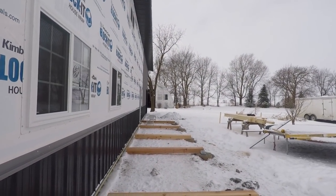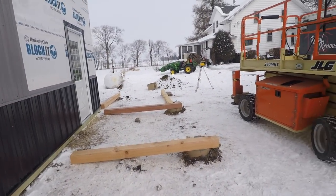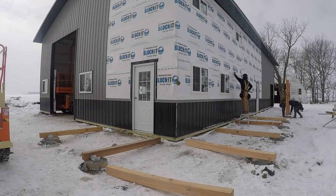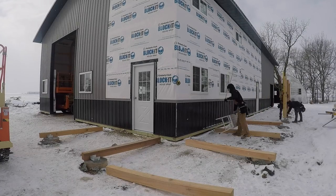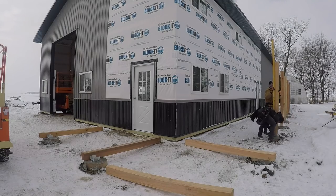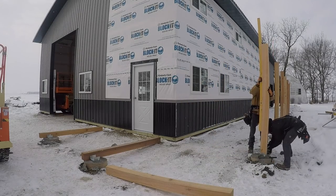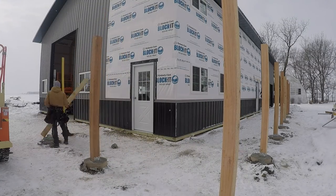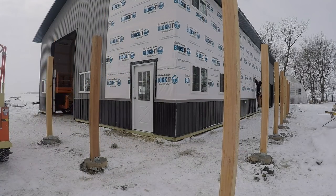Just a nice little gentle snowfall. I love doing these cedar porches — they're actually very easy to do. We've got them down to a science because this is kind of our style. They look really nice, so it's a win-win. What we're doing now is we've laid out all of our posts, leveling them up with the eight-foot Stabila level and putting some smaller wood screws into the bracket.